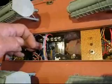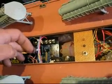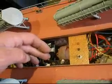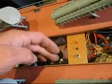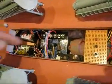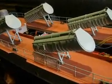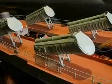Let's have a look inside. Timer module — this is the servo who controls this timer module. And if the servo is pushing against this little switch over here, the glow plugs will start. There is another safety device inside the tubes. I can only ignite the glow plugs when the tube is stirred open.